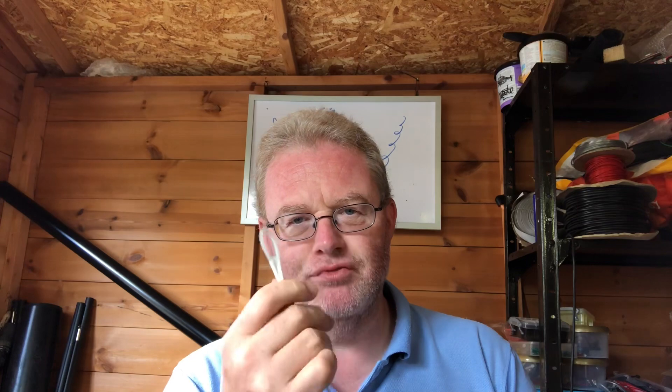The hint and tip with these antennas is to make them a tad longer, which allows you to tune them and gives you a bit of a fallback. You can make it permanent — you can heat shrink it, maybe epoxy it as well if you wanted to — but with epoxy it's not easy to retune, so for me tape is good enough. It's easy to sort out if anything goes wrong; just take a nice reel of tape with you.